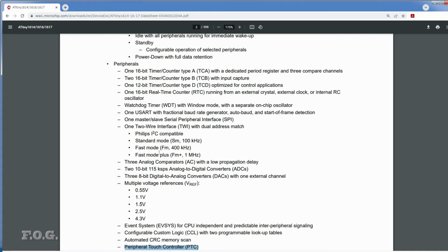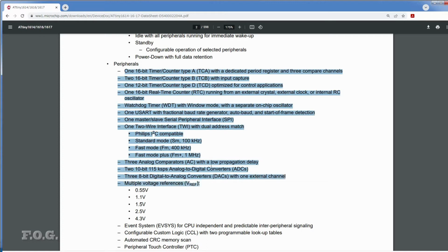I really like it. Now, typically when you see all of these peripherals, I don't know how much of them are implemented in the drivers for Arduino. And as with the STM32, a lot of these custom peripherals don't work within the standard IDE capabilities of Arduino. So it's usually depending on specialized classes that have been built to drive these dedicated or specialized peripherals. And really, that's unavoidable. I mean, you can't really encapsulate a standard to cover all different types of devices where you just don't know what sort of feature sets are going to be plugged into them. So that's something you have to live with in Arduino. You think everything is compatible with everything. It's really not. You really end up having very specialized capabilities for different chipsets. But if you're aware of it, you can manage that. And I think it's not the end of the world, that's for sure.